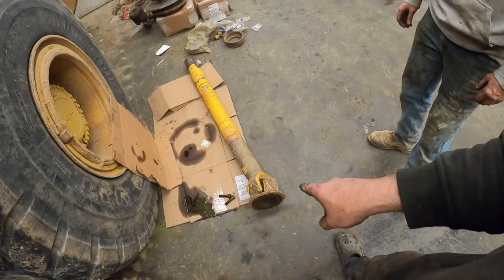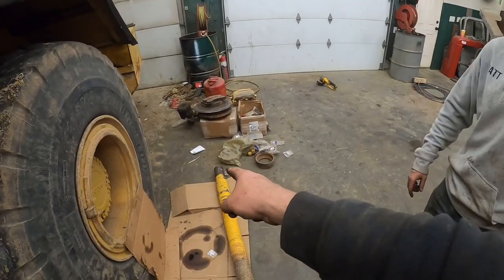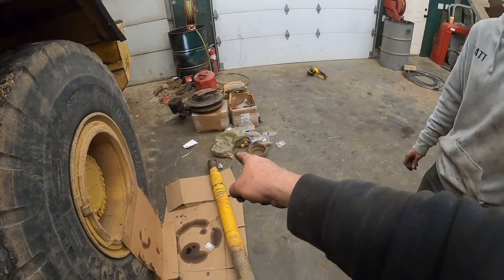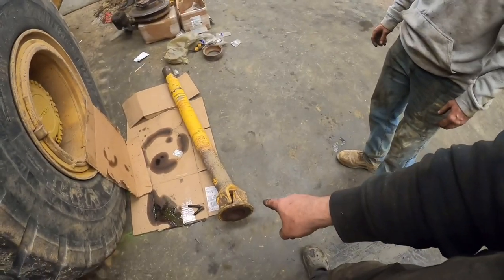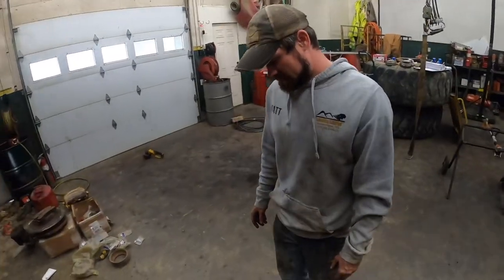This universal joint here has to be... You pointed at no universal joint. Well, the one that's in the truck. That's a rotor and brake pads. The one that's on that end. You're confusing me, man. So this universal joint has to be phased with that one to remove that pulse so you have an equal or a consistent turning.